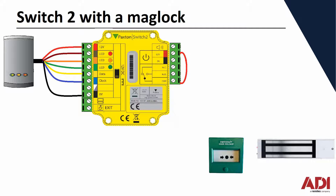With that in mind, we need to give constant power to the magnet and we'll be switching positive. We need a link between the positive of the incoming power and common on the relay — you can see it's just a wire between the two terminals. Then we'll come out of normally closed, via the green escape button, to the positive of the magnet. We've now fed positive through to the magnet via the normally closed relay and the green escape button.